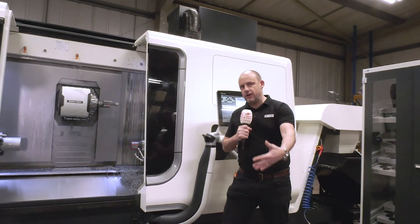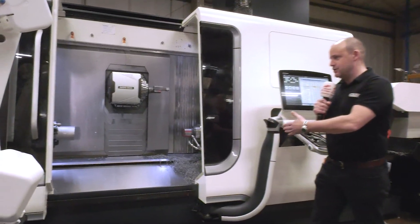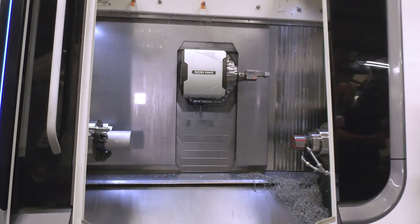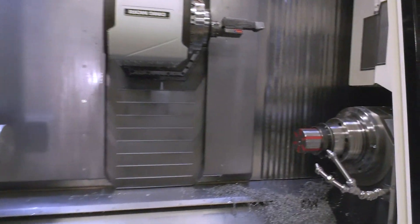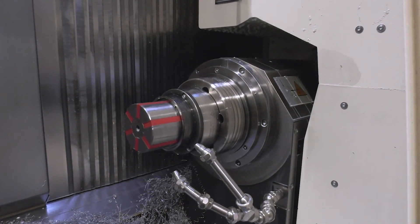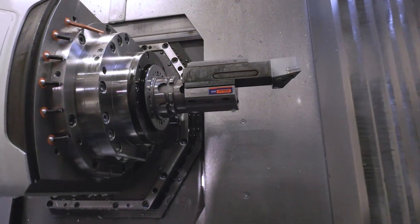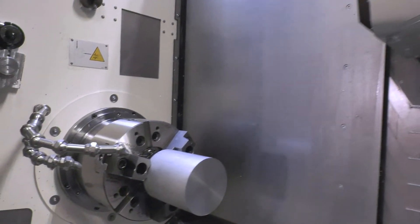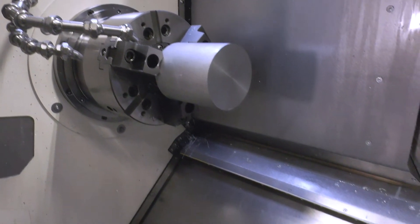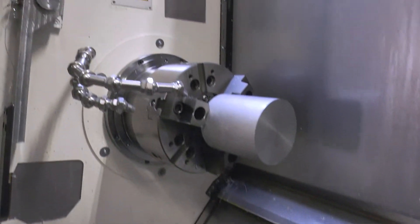The whole concept of this machine is about one-hit machining — producing a part complete in one hit. You've got two spindles here, two very powerful and fast spindles, over a metre between centres, and a machine that has features like linear scales, an HSK spindle on the milling head, and an 80-tool carousel. Long gone are the days where a turning machine with mill-drill is simply for small holes or light milling cuts — this is a true milling head. The machine also has liquid cooling on the spindles and on the axes, so minimal thermal growth however hard you're hitting those parts.